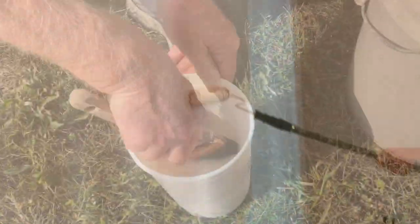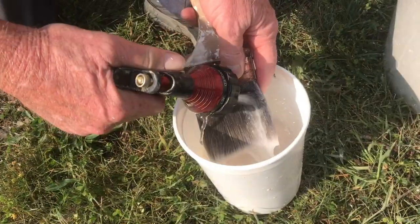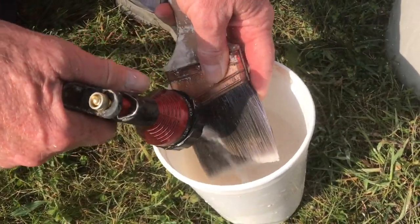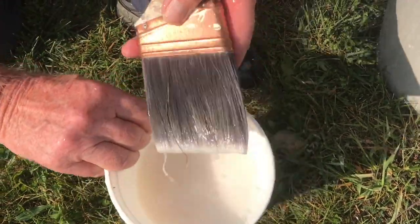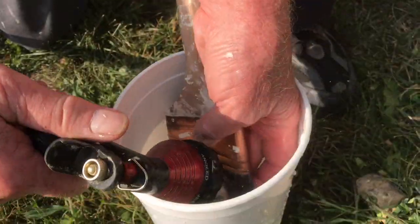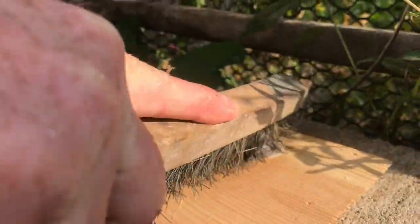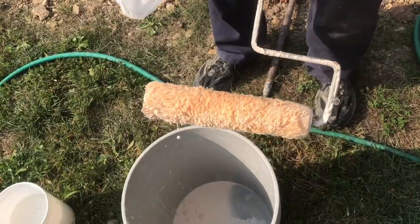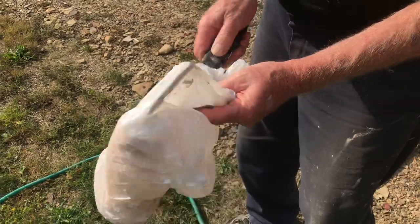Now that the paint is on nice and clean, it's time to clean everything up. Just rinsing out the brush is not going to be enough — you've got to scrub that paint out, and in the end you'll need a wire brush to get everything dug out and straightened up. If paint is left in the bristles at the base of the brush, it's almost going to be ruined. This wire brush not only cleans everything out but straightens everything too. If you're painting the next day, just wrap everything up in plastic — we've even thrown it in the freezer.